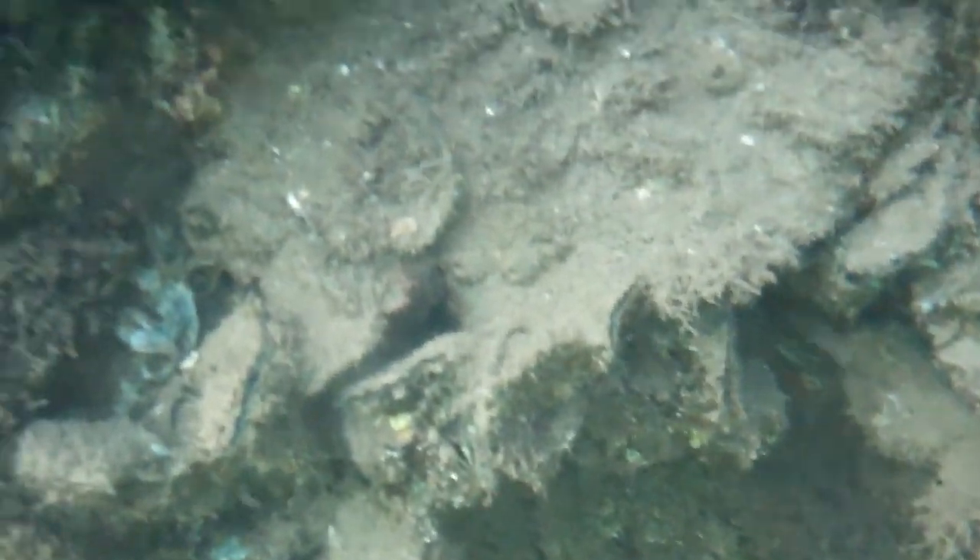The bottom of the radius is open. This pile is cracked — that's the third pile — with some cracks on the cap area. Looking at the condition of the radiuses, they're all very old and were reapplied over and over. You can hear how hollow they are, so they're not really holding any water and soil — especially not the bottom. You can see fill soil on the bottom of that radius as well. It gets kind of deep here very quickly — about four to five feet to the drop. Again, horizontal crack in the panel.